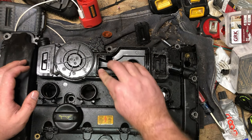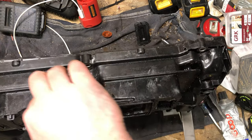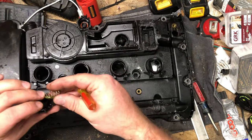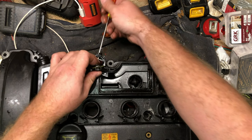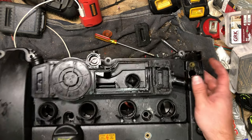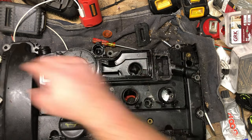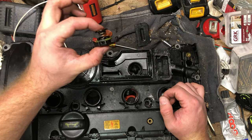There is an O-ring. I think to get this apart we're going to have to cut it as well. Let me try and get this little cap off first. Oh! Okay - so that's going to be another blow-off valve, and this one goes against a spring, as you can see here. That one was just open - purely air pressure. This one's also going to have to overcome a spring to pop open, so it's another check valve.